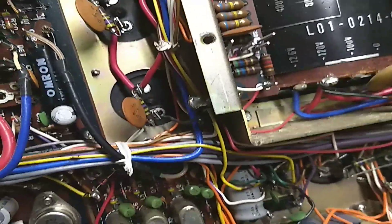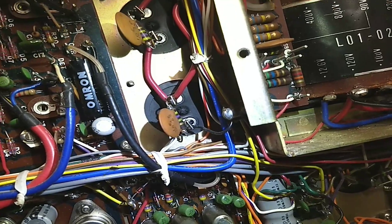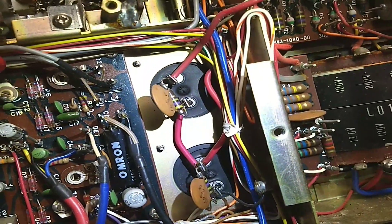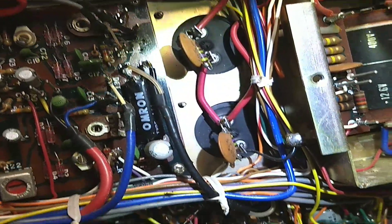There's another one on this one here. You can see that bulge on the bottom of the capacitor — that's not a good thing. There's one on that one and one on that one. Those capacitors are actually a little shorter than these big guys, but we're looking at them from the bottom of the board. That's the bottom of the capacitor, and that's where the bulge is.